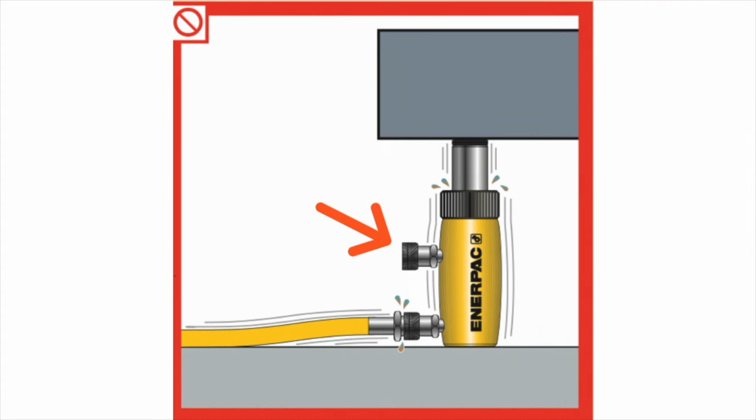Beyond that, a blocked coupler can cause a very dangerous situation in a double acting system. You'll want to check out our video right here on coupler safety. For the sake of safety and to avoid possible downtime and restricted flow affecting your overall efficiency, it's best to just not take a chance with using different couplers with each other.